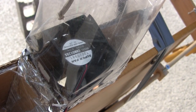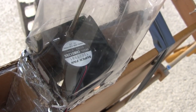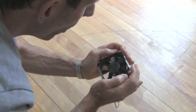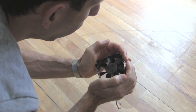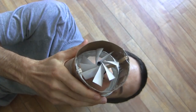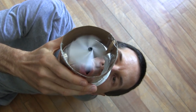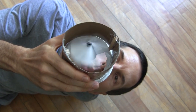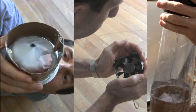If I put a stick down there I can see that I can turn the blades fairly easily, so they're not stuck on anything. Here I'm blowing on the PC fan to get some idea of what air flow is needed. This makes me think that while my solar tower can turn a paper turbine easily, turning a PC fan would take a lot more. And to give you some idea of how my three different blow strengths compare with what you saw with the solar tower, here I'm doing it with the paper turbine. The light blow, medium, and strongest all turned the paper turbine faster than the solar tower could.